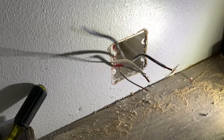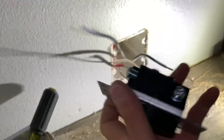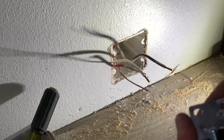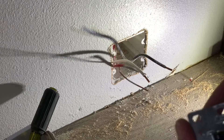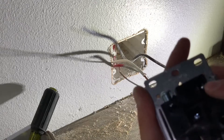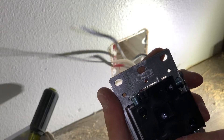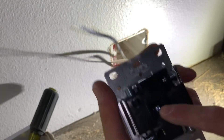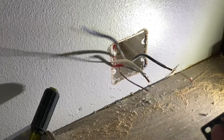I got all the wires already stripped out and ready to go. I'm just going to grab a screwdriver. These are all silver screws so that's annoying — you just have to read it. There's a spot for the white, the green, and X and Y are your hot wires — so your red and your black. This one says white is for white, green is for green, and X and Y are for your red and black wire.